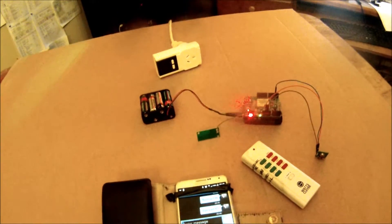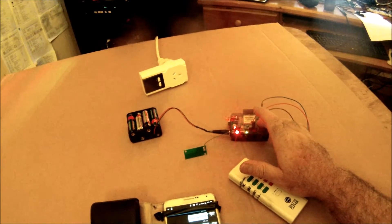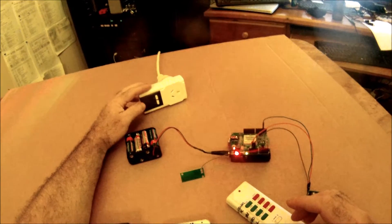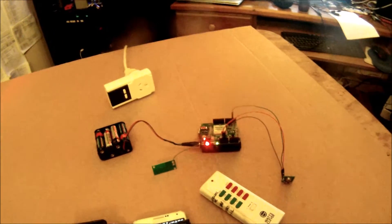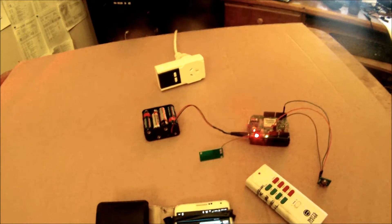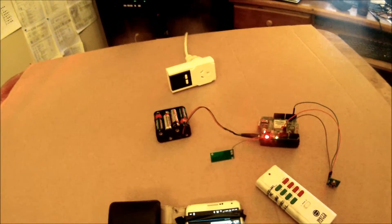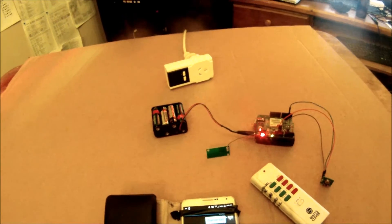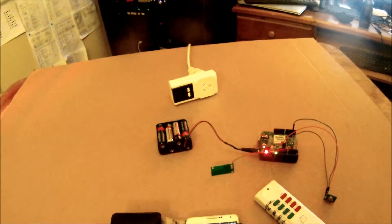So that's just a quick demo of how it works. The SIM Shield is somewhere between $30 and $40. These sockets are somewhere between $30 and $50. The Arduino is probably about $10 or $15, and the ASK433 transmitter is $2. The SIM card — I was able to get one in Australia for $5, which has 365 days access and $5 worth of credit at $0.12 per SMS, and that's on the Telstra network.